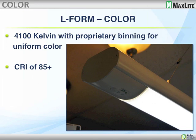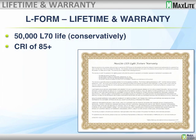The photograph in this model shows the built-in motion control — this would be an end model for continuous run. We have conservatively rated this product at L70, 50,000 hours. I say conservatively because when we have the final product from UL/ETL, we will run the TM21 report. I estimate we're going to be well above 70,000 hours at L70, but out of the gate until the 6,000 hours of testing is done, we will rate the product conservatively at L70, 50,000 hours. This product does have a full five-year warranty, as do all MaxLite LED products.